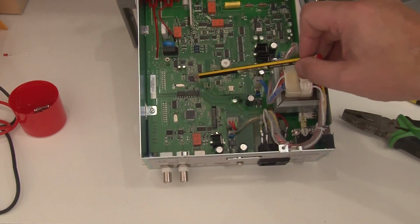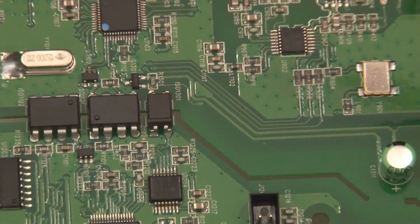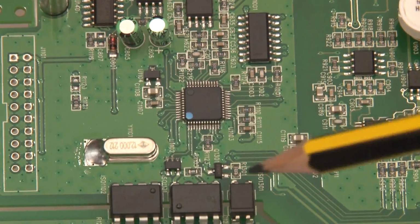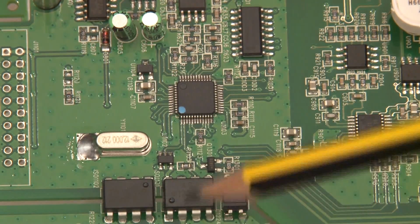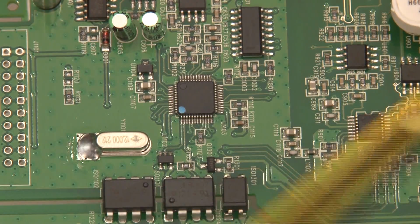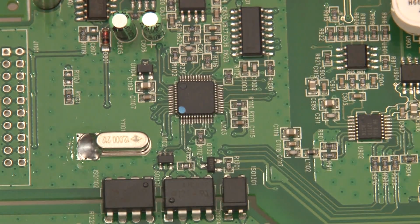And by the looks of it, this over here is another microcontroller. Let's just figure out what that number is, if we can get to see it. It's running at 12 megahertz. I'm guessing it's a microcontroller because of the density of the pins and also the vicinity there. It would make sense that the main controller down here, or the controller for the USB at least, is communicating with another microcontroller. Let's have a look and see if we can find out what that part number is.